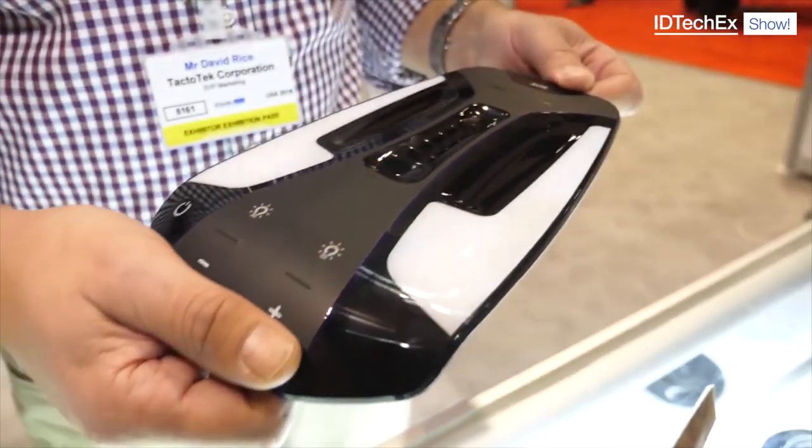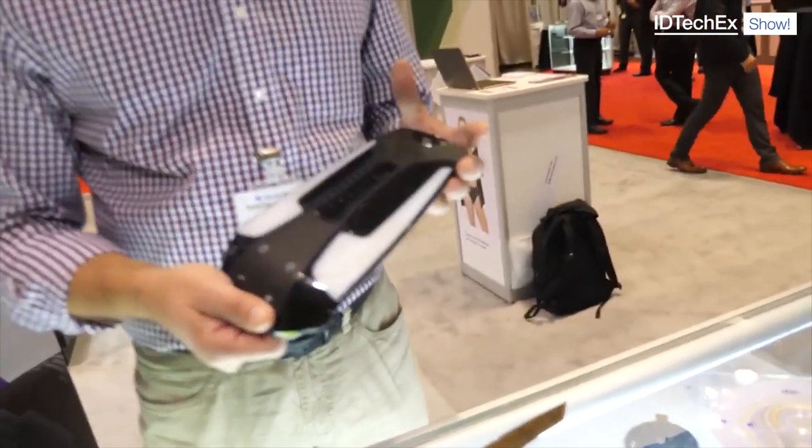And you have an antenna near the surface that's going to work massively. That's right. We have a large surface area in which to print an antenna. That antenna is printed — it's not a separate piece, printed just like our electronics are printed, although we do use higher conductivity inks to optimize antenna performance. I would guess that must surely be at least 10 times as reliable — there's nothing to go wrong, no rocker switches, no plug-in bulbs, no pieces, and you're enormously reducing the part count.